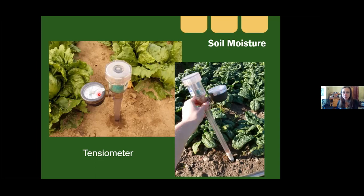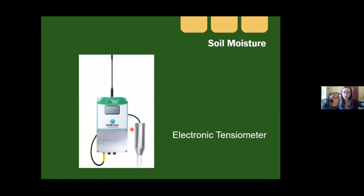And, you know, over the years when I've done soil moisture monitoring, some folks have said, I love the tensiometer. I understand what it's telling me. I walk my field every day. I read the dial. Great. Most growers these days, they don't want to do that. They would rather have something where they're getting it electronically transmitted to their cell phone. So it's up to you. I do find that I have preferred an instrument which the data is being logged.